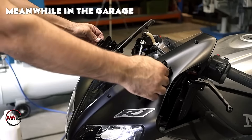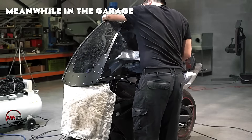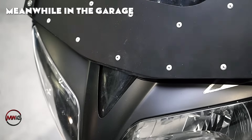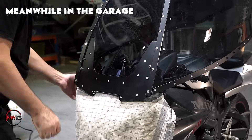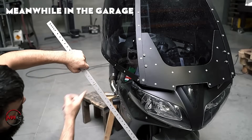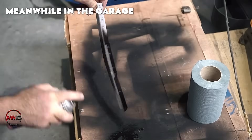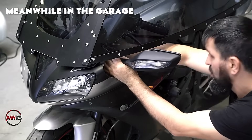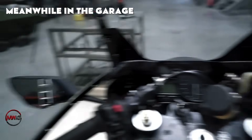At this point, exact measurements are made to confirm the cockpit is centered and doesn't obstruct the rider's controls. The overall design of the cockpit significantly influences several critical visibility points. The stock rearview mirrors stick outwards, and their usual mounting point would fall within the cockpit's edges. Once the new mirror positions are determined, the stems are either shortened or adjusted to a new mounting location, with shorter versions fitted to stay neatly out of the cockpit profile.